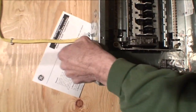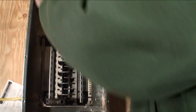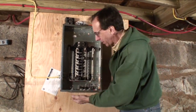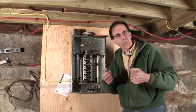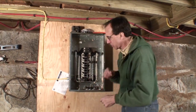We've got a slightly smaller one here for small Romex and a bigger one for larger wire. We always use these when passing through the box, because when we take out this slug — this knockout — we wind up with a sharp metal edge. We want to make sure we have a smooth edge where the wire is passing through because we don't want it to chafe.